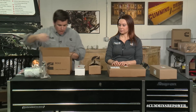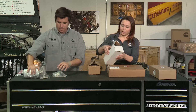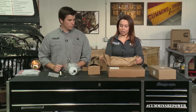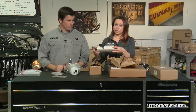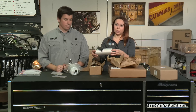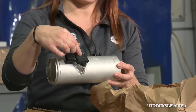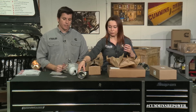The other thing you want to make sure you don't throw away from that box is a pair of MAF sensor screws and the MAF sensor itself — it can get lost in the bubble wrap. You really need that to get your engine running. MAF stands for mass airflow, and it gets installed in this tube, which was specially designed to work with our calibration in the engine ECM. It measures the amount of fresh air coming into the engine and gives you the correct ratio of EGR to fresh air. Make sure you use this tube, or design your own with the exact same dimensions. There are arrows on the tube and the MAF sensor indicating airflow direction — pay attention to those.